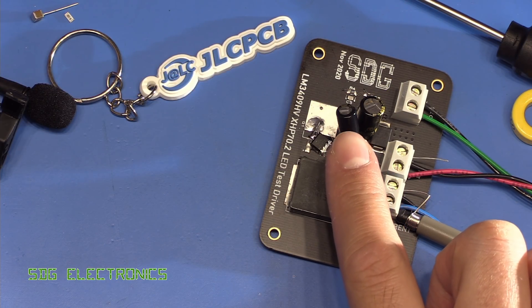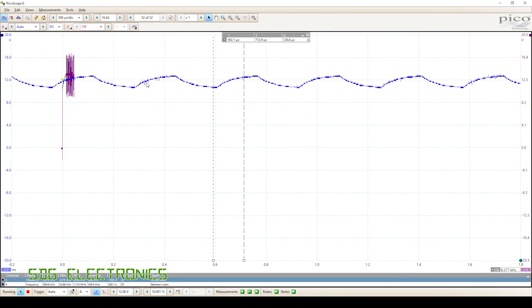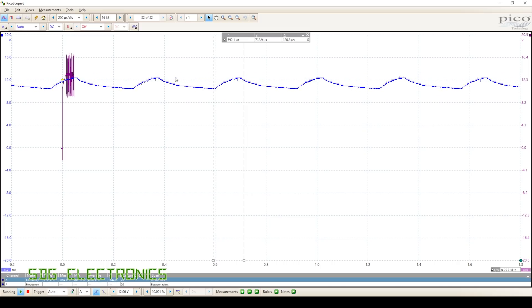We've now got a 68 microfarad electrolytic capacitor gingerly soldered across those two pads — just one I had to hand, about three times the value of the ceramic capacitor originally there. Looking at the waveform, it's had quite a significant effect generally. What it's actually producing is an average current into the LED that approximates the dimming we're trying to do. So in fact a large electrolytic capacitor would actually have a much better effect on the LED and the overall waveform than a smaller ceramic capacitor. It's certainly got rid of the switching noise, so an electrolytic capacitor there is an option.